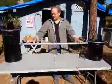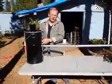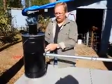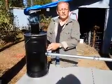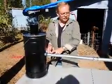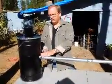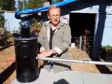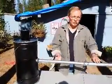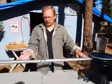Now, when we've got this thing put together, the heat is generated within the reactor, and the hot gas is coming out: hydrogen, methane, CO, along with some nitrogen, but it's very, very hot. And what we need to do is cool it down to a certain degree before we get to the water. So right here we're going to be 350, 400 degrees. It's going to be pretty hot here. And as you go along, it's going to get cooler and cooler and cooler. By the time you get all the way over here, it's actually below the boiling point.